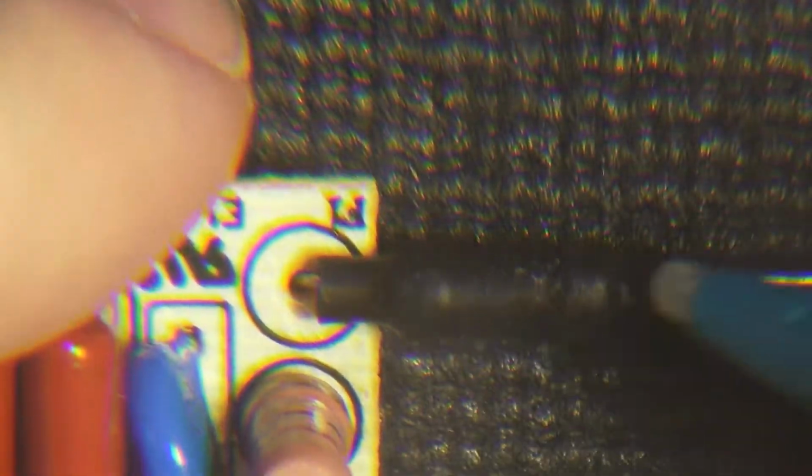All right, so there's the input fuse. We'll have to take off the heat shrink. It looks like it's just a resistor, but let's see if we can focus a bit better here. So here we've got the fuse marked F1, but we'll have to take off the heat shrink to be certain that it's just a resistor, because that's what it feels and looks like, but we'll check that in a second. Probably an inrush limiter resistor, and then we've got a little filter, assuming so.